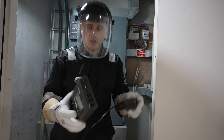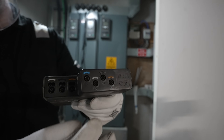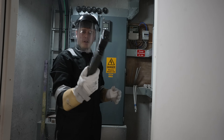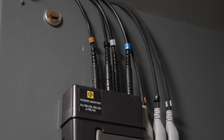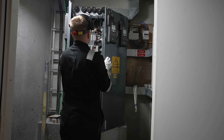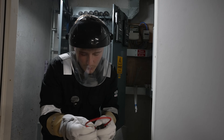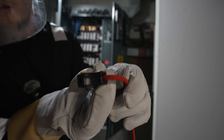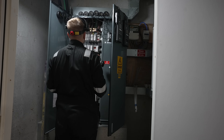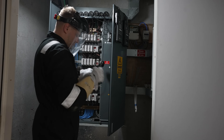These actually have a power adapter where they can power off of the incoming voltage. It's going to pick up the three phases and neutral, or single phase and neutral from here, and then we can pop a figure-of-eight lead in there — that's basically a pass-through adapter. Now we want to do our Rogowski coils. Like any CT, these have a direction of current flow, so it's really important to make sure this little arrow here is facing the right direction. We're going to start with landlord supply one.